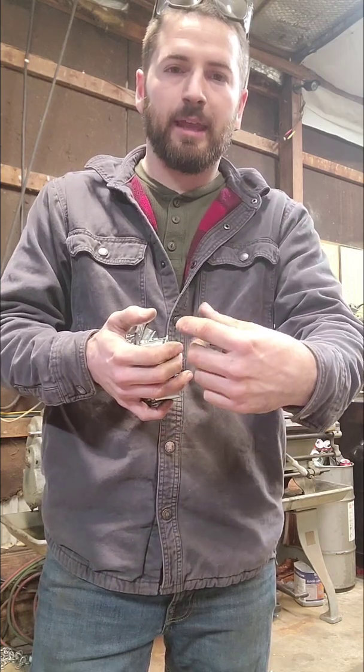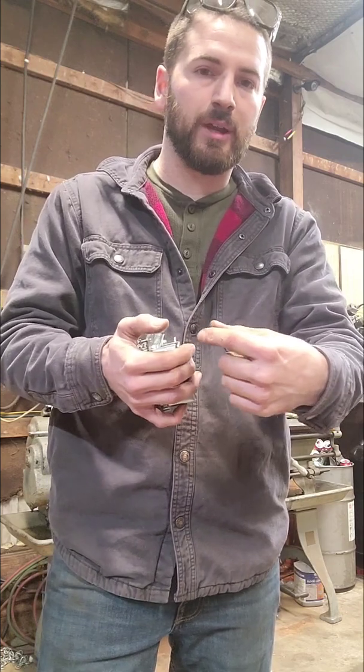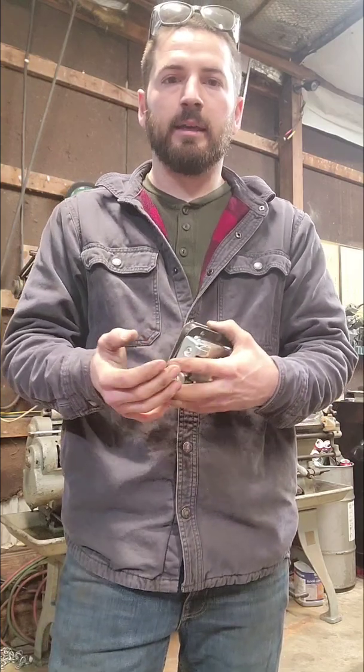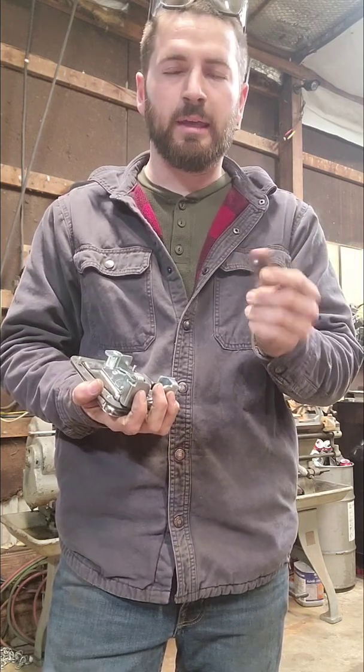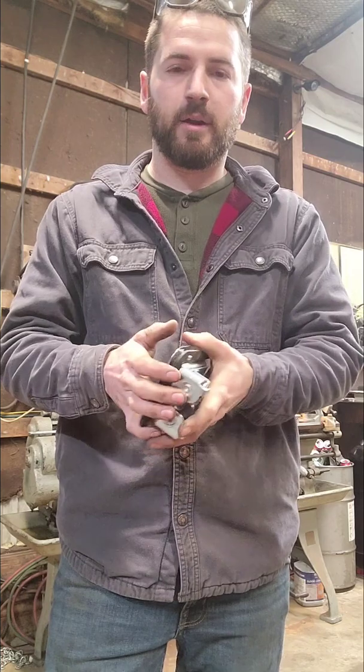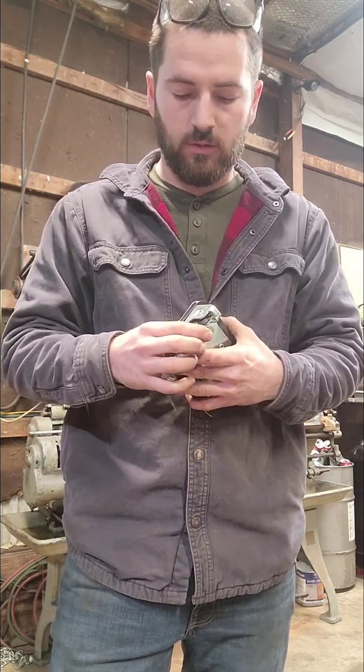You can take that half-inch nut on the back end, loosen it, and bring your striker pin in or out more. Or if the weather stripping goes bad completely over the years and needs to be replaced, and he can't find the same thickness weather stripping for whatever reason, you'll have that little bit of adjustability on where your door latch is at. So I think that'd be kind of a good touch too.